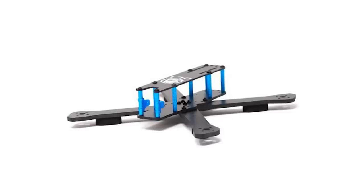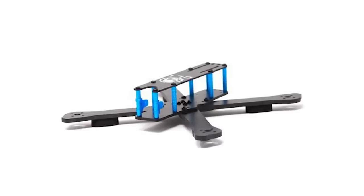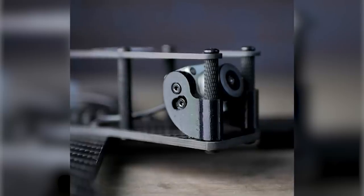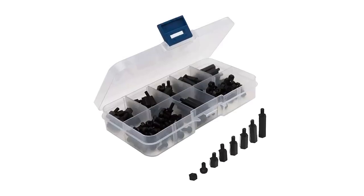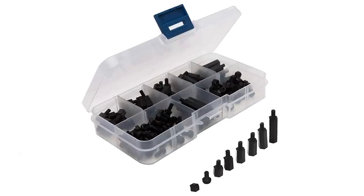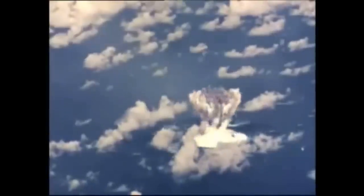How to ruin your drone build. There are some things you might want to watch out for — little ideas someone had to reduce weight or make the build easier, but when the props hit the air, some of these things just straight up ruin your build. You're probably doing some of these things now and might think they're a good idea. Well, you're wrong. Nylon standoffs: most drone frames have arms, a bottom plate, and a top plate separated by standoffs. Those standoffs really need to be hard metal — at least aluminum, maybe steel. There was a trend to use nylon standoffs because they're lightweight, and a number of frames shipped with them. But your first crash — they strip, they break, they melt with your soldering iron. You are ruining your quad if you put nylon standoffs on it.